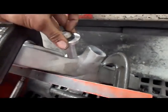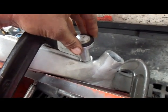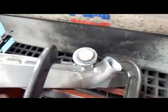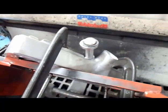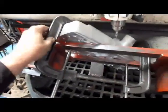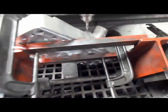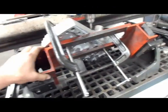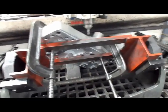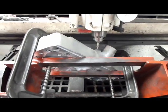We have a special little setup that we've made for things like this, where we have a fairly small diameter — we can use a bullseye level to get the thing leveled out, and then we can drill it out. This is a fixture I've made for holding Volkswagen and Porsche cylinder heads when I do them, and we're actually able to use it for multi-functions here.